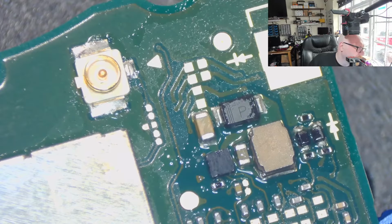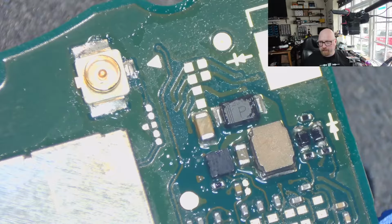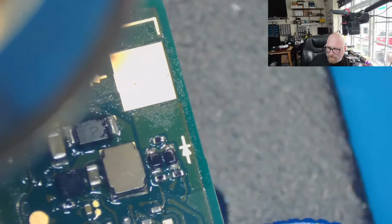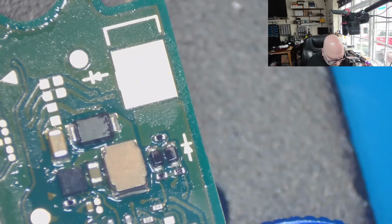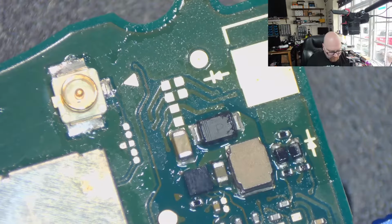Alright, hot air, 470 degrees. And airflow 10, 8, 10, to be very, very low. We don't want to blow this chip again. No, it's not ready yet, but hopefully it's in place. I'm going to use more airflow, 14, 15.